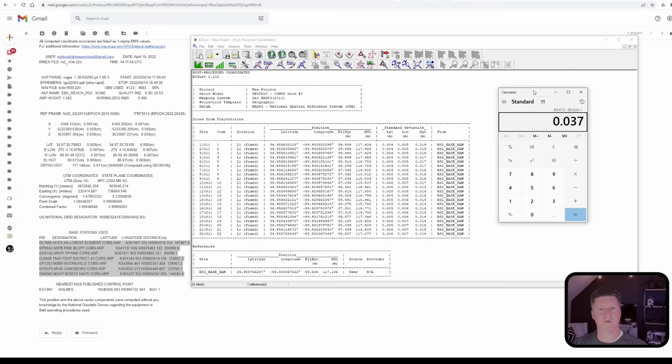But you do have to know whether those values were in NAD83 or WGS84. We've already talked about what they most likely will be, but you have to know that. Now, if you're doing processing in NAD83 but you use WGS84 values, that can actually create problems. It's going to put your base where it's not really, and that can enter error into the calculations, even if they have done everything correctly on their end and there wasn't a grave error by the person that set up the benchmark.